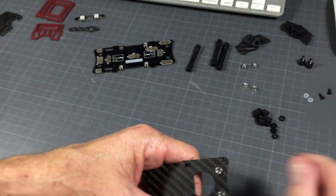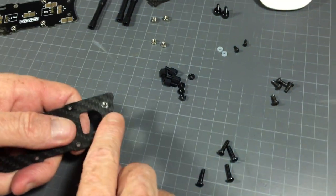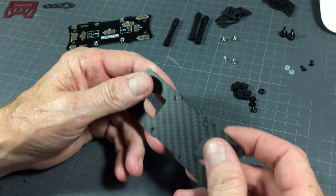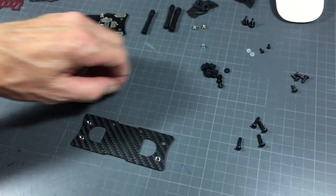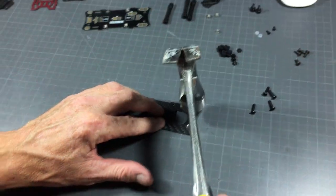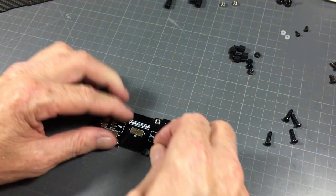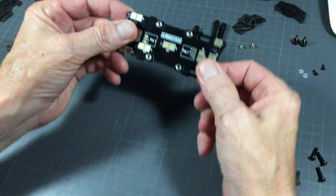With this model it poses even more of a problem because we're using 8 millimeter bolts, and at 8 millimeter it works great, but it will not work at all unless your sunk nut is already fully seated. If you try to pull those nuts using 8 millimeter from the other side, it's going to strip — guaranteed. So the first thing you want to do is install the sunk nuts in your two plates. The way to do this is simply center it as best you can and use a hammer, making sure the sunk nut is totally in, nice and even.